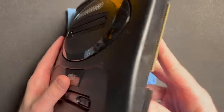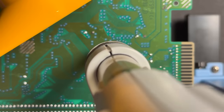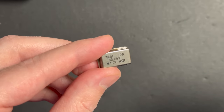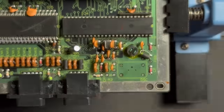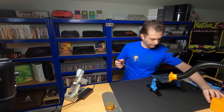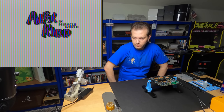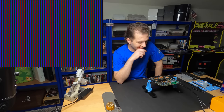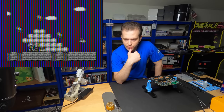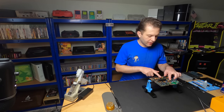I grabbed the ugliest Model 2 that I have - this one's definitely seen better days. And we have ourselves another NTSC crystal. We're back with the Master System 2 - let's remove that crystal, grab the Genesis crystal, marker on the top right, and pop this guy in. Same as before - wow, this thing really does not like this modification. So it's not the crystal; that replacement crystal was just fine. Let me do a couple of voltage checks around the two modifications I made. I want to make sure pin 7 on the RGB encoder is indeed 5 volts and pin 57 is indeed ground. Pin 7: it's 5 volts. Pin 57 should be 0 - which it is.